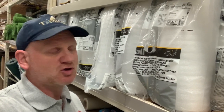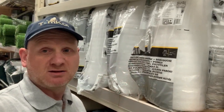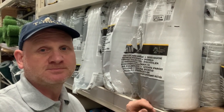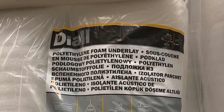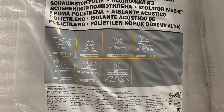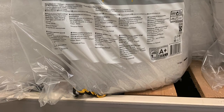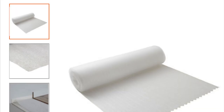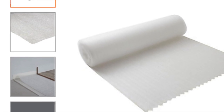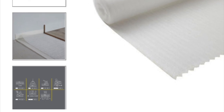This is probably the most common underlay used - this is the polyurethane 3mm foam underlay, which again stops sound. This foam underlay can be used in any room and is suitable for use with underfloor heating, though it's suitable for less frequently used rooms. It improves walking comfort and reduces footfall sound from the room below, and also helps to level subfloors with unevenness of up to one millimetre.